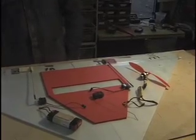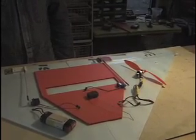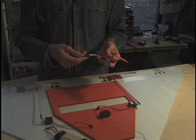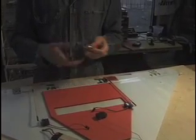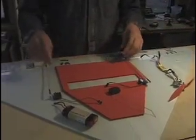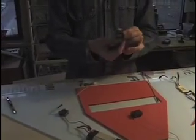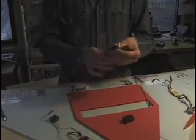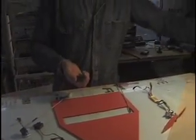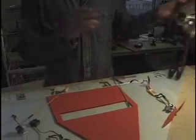To build a Tau Delta Wing, you need to buy some parts. We tried to get the cheapest parts we could and found a nice combination that ends up being around $100. First thing is the motor and speed controller — they come in two pieces, you have to solder a few bits together. We also added a quick mount for the prop; the propeller is about a dollar, so that's about $20 total there. Next you need servos — we found some very inexpensive ones at about $8 each, and you need two of those. They're standard RC plane servos. Next you need a radio and receiver — we found one that's about $50.